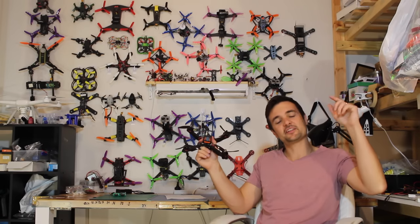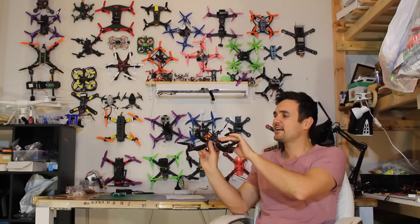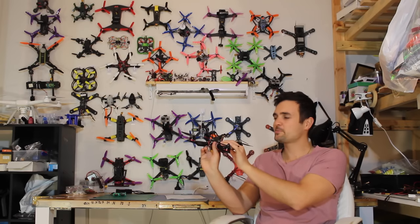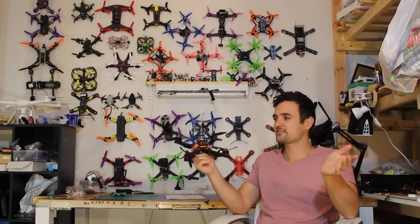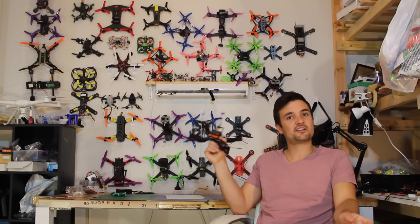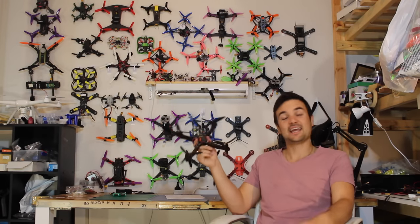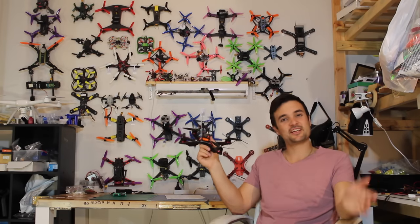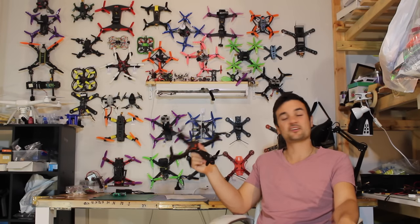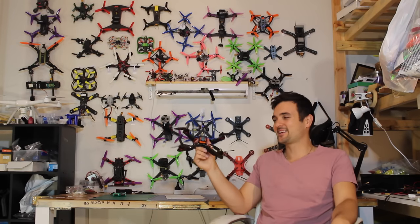Now, I'm gonna leave a couple of other guides down below. I know a guy called Crazy FPV, and I actually watched one of his build videos, but he also did one on how to flash the firmware on the VTX here. Just note that if you do get the Australian version, it's limited to 25 milliwatts because that's what's legal here. If you wanted to, there's also the international firmware on the website, and he goes through a guide on how to flash that onto your board.